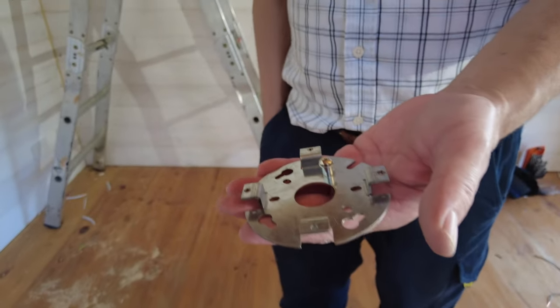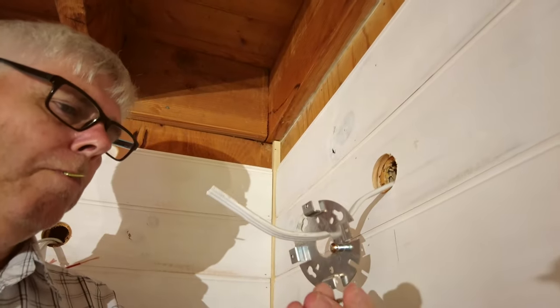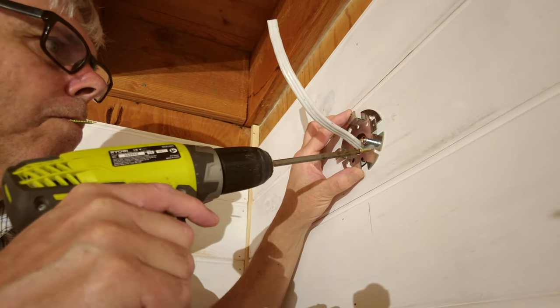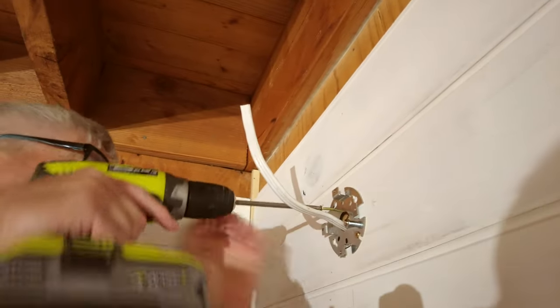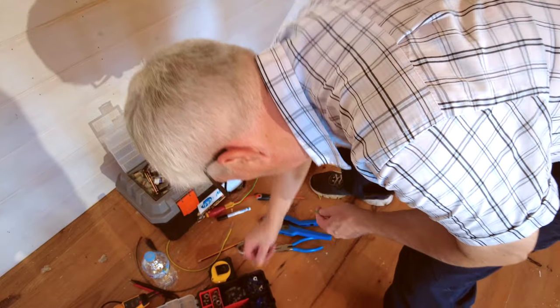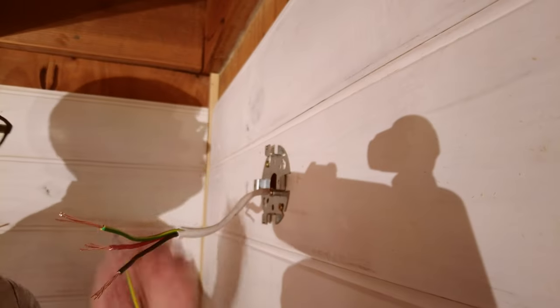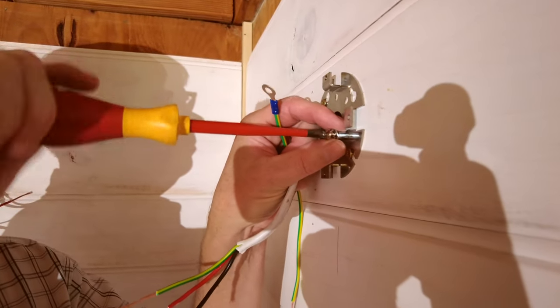This is the mount plate — obviously it comes out of there — and we're going to mount this now on the wall. We're just creating the little earth connections. These earth connections have got to be attached to each removable part of the light, which is the main wall plate and also the mount plate. That also needs to be earthed and wired into the building earth. So what we'll do is pull the little screw that we provide and we've put a little crimped tab onto an earth cable to begin earthing the components.